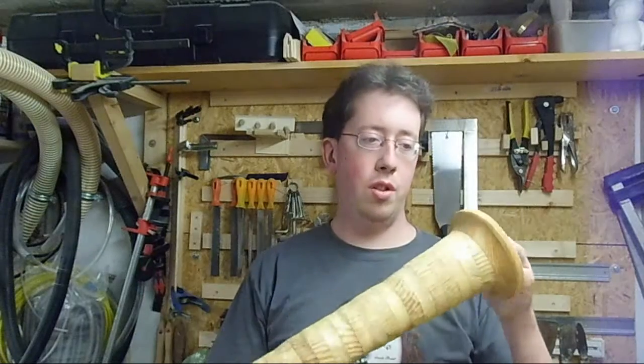So the horn is finished. Well, not exactly. I'll let the oil dry for a few days, then apply a few more coats. What I used is actually not pure oil, but I think it's called half oil. It's half oil, half paint thinner, meant to further penetrate the wood on the first go. The next coat will be pure boiled linseed oil.